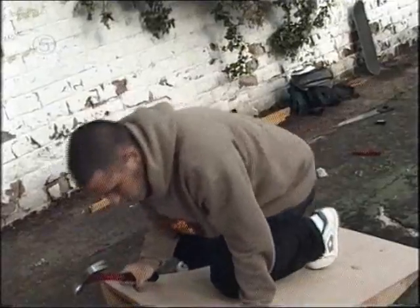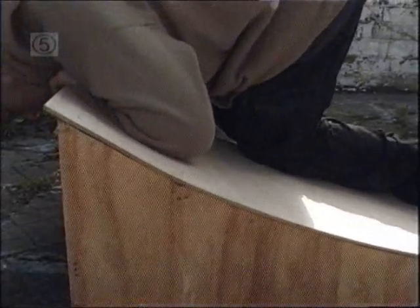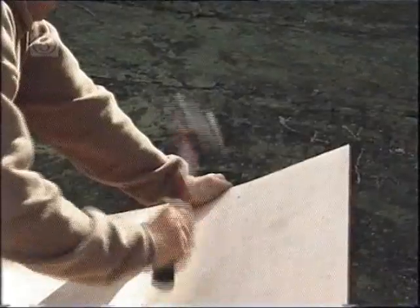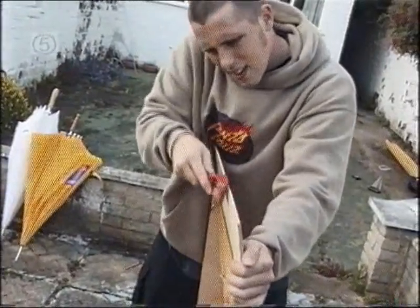Lay the surface over the frame and mark off where to trim off any excess surface. Leave a little bit of the surface overlapping the bottom lip. Cut to size, then screw or nail into the struts. The top surface needs to be flush with the floor. This is achieved by planing or sanding the underside of the top surface until flush.